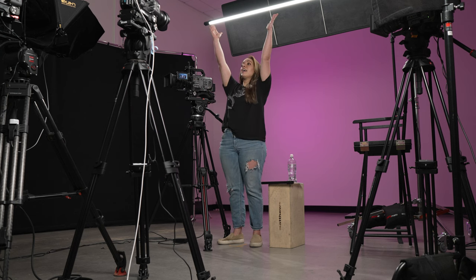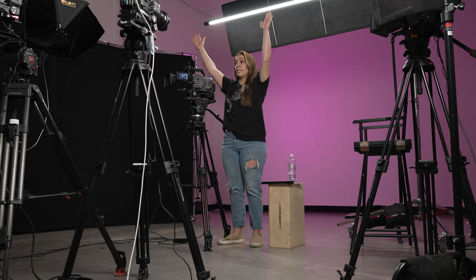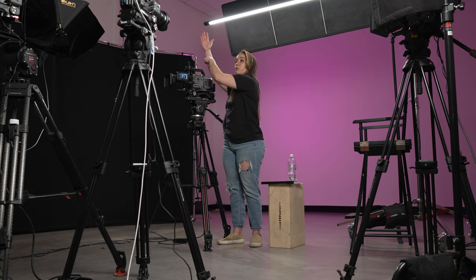Way back when television was invented and broadcast stations started to pop up all over the place, these stations would plant themselves where they saw fit and claim airwaves. This is my airspace. When neighboring stations would plant themselves too close to each other, their airwaves would start to intersect. This caused things like audio bleed over, shows would step on themselves or get super staticky. The government decided to step in and break up the fight by establishing legal limits. So each station was only allowed to stay within their airwaves boundaries, leaving a little buffer before their neighbor's airwaves began. 709 was created to take all the picture information and consolidate it into these legal limits.